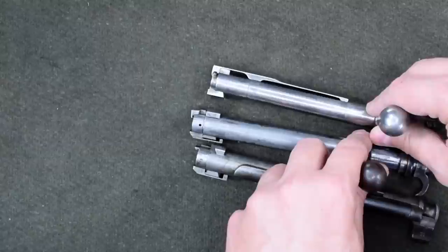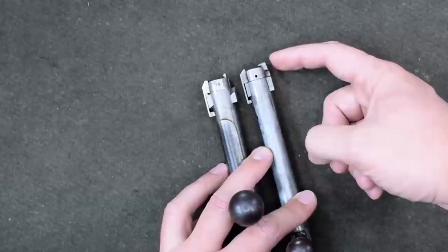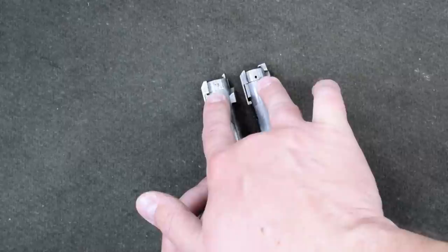And look at the Mannlicher guns, because for sure, we've got very similar systems. We have an extractor over the side, although it's been buffed up much more than sort of the Dutch pattern of Mannlicher. It's almost halfway between this guy and that guy. Now, we have an ejector on the side that would hit the bolt stop and then pop forward, so that's also very similar. And we have fixed non-rotating bolt faces that are flush. I'm not sure how easy that is on the camera.